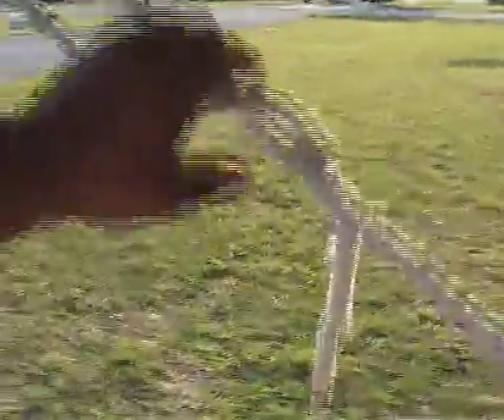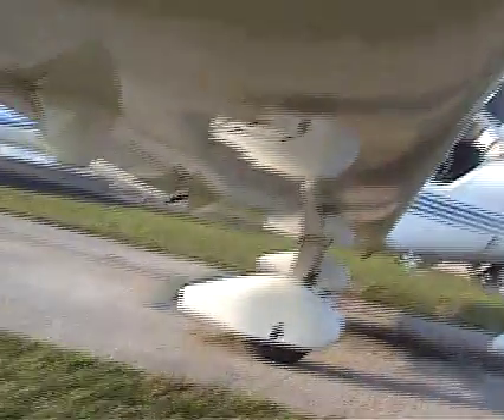Go ahead and take the tie down off and leave this here — pretty much so we know where to stop. Line the DA40 up, look at the wing, pretty much the general condition of it, looks good. Looking at the top, check my stall strip.